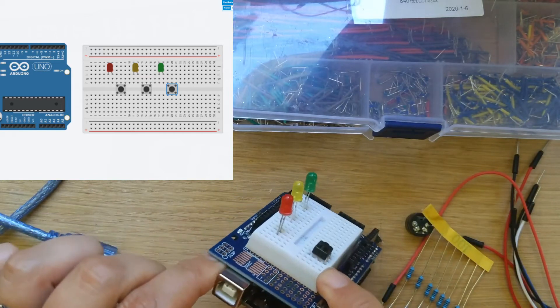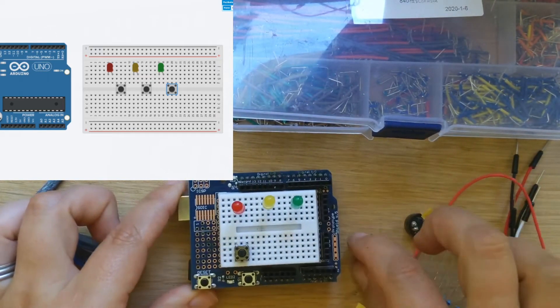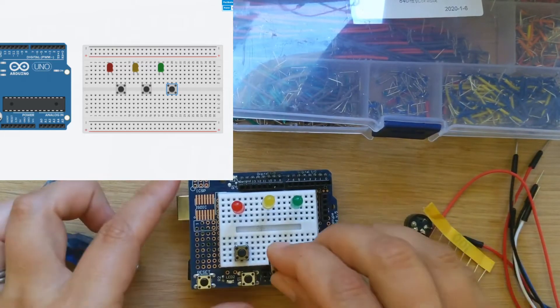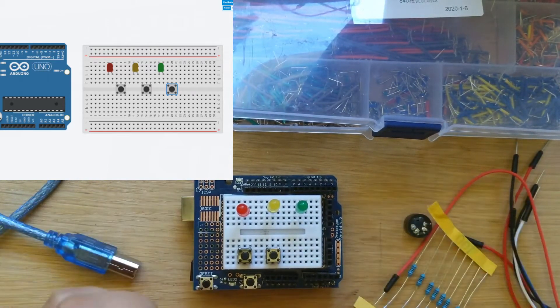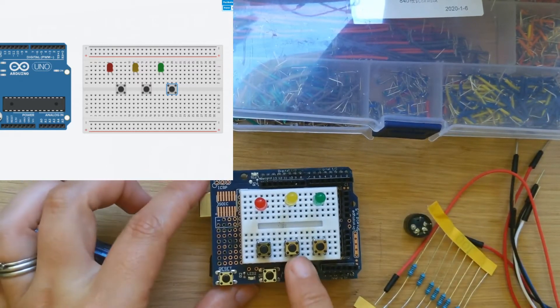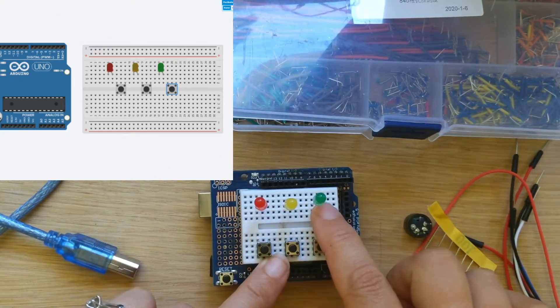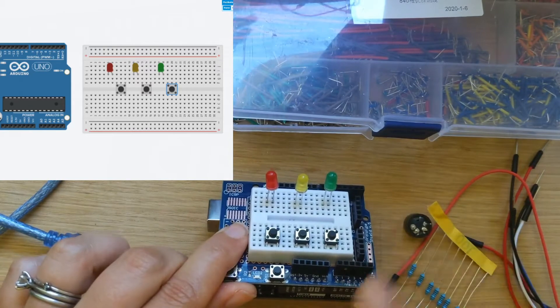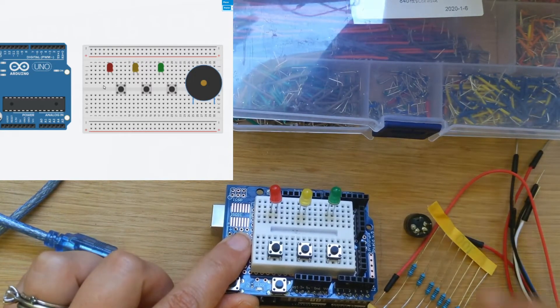It should span two going vertically instead of horizontally. We're going to put our buttons right underneath these LEDs, with two columns in between all of the buttons. If you wanted to, you could cut the legs down so it'll be a little bit more secure later — that's something you can do after you make your circuit work.